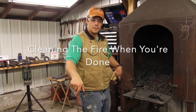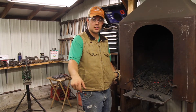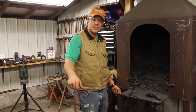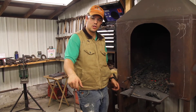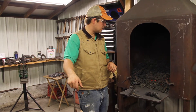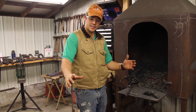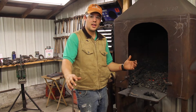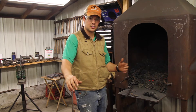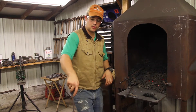We've got a pretty good size clinker in this fire. I've been pretty fortunate with this fire pot. This fire pot's about five years old and it just has a small crack in it. Two things I think are the reason for that: I've got a half-inch plate to hold it, and what that does is it acts as a heat sink so it doesn't allow it to heat up too fast. It doesn't allow it to cool down too fast, and I think that's what helped keep it from cracking. The other thing is I always clean it out when I'm done. That clinker stays inside there, it solidifies, and as that steel shrinks it's going to put pressure on it. If you ever clean the clinker out on a cold fire pot, you know how much pressure is being held in there. So I always clean it out. I build my fire up, turn it down, and that allows for a more even heat and allows it to cool down a little slower.